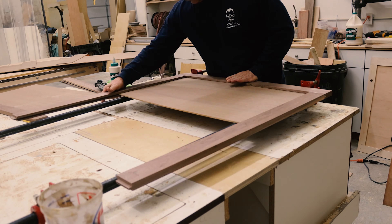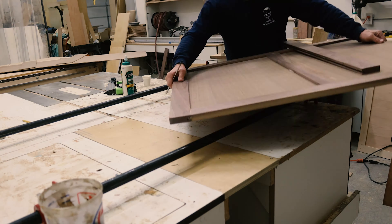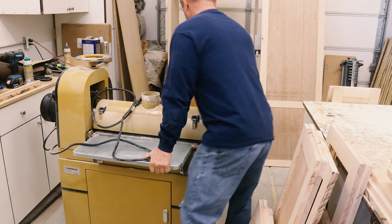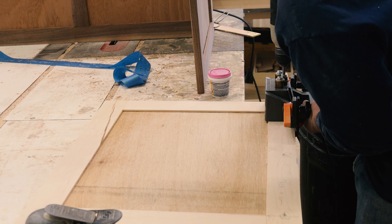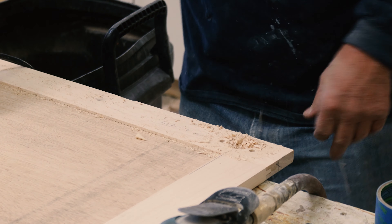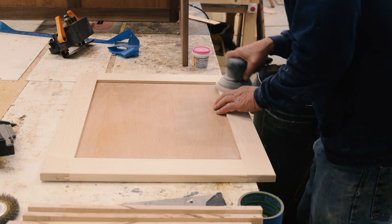I started with the corner panel — and of course sanding, round over, and more sanding. Building the walnut panel that's going to wrap the whole island peninsula — I ran every door and panel through the sander, which took hours. I leave my rails and stiles fat so I can trim a little bit off both sides — this gives me my perfect dimensions and makes everything nice and square — then a little round over.